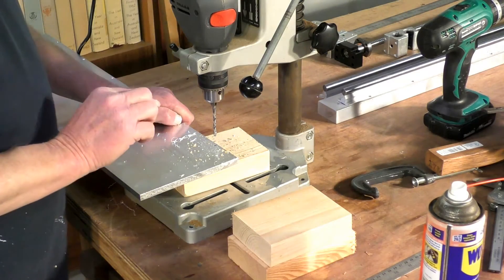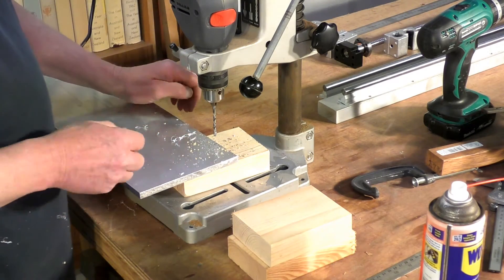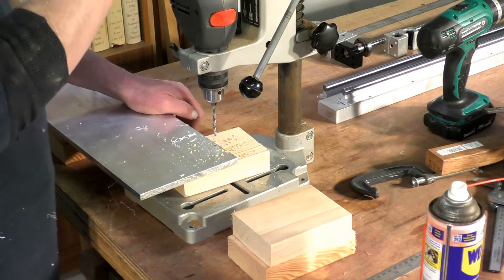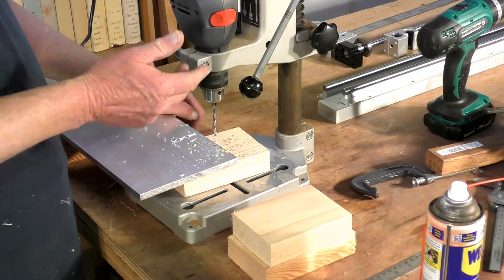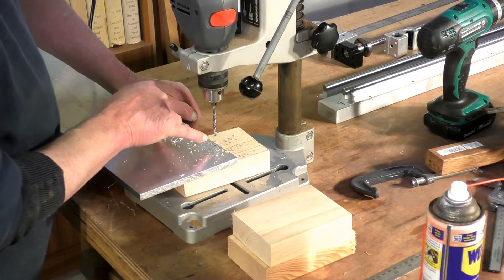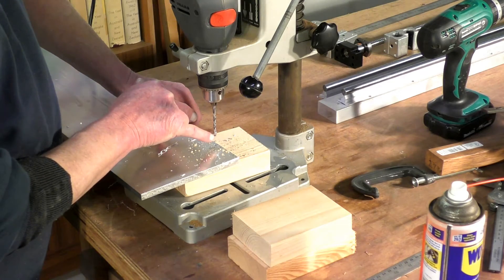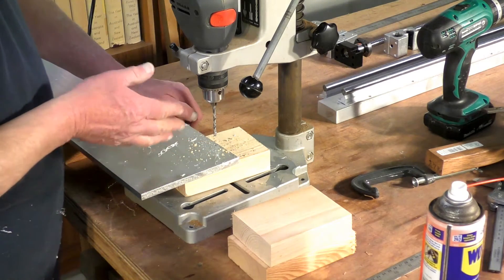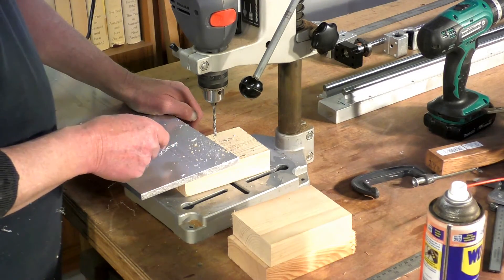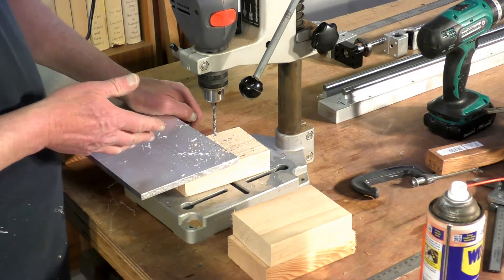That's what's commonly known as peck drilling — you peck it like a bird. You go through about a millimeter, or a sixteenth of an inch, then withdraw the drill back out, then put it in again another millimeter. It goes through all the way like that. The material coming off doesn't clag up on the end of the drill or weld itself to it, because you don't give it long enough time to get too hot. You can clear the hole out — and that's the way to cut, especially in aluminium.